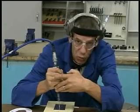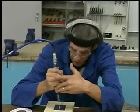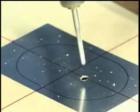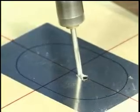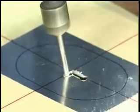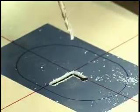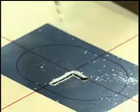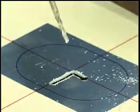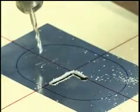The trigger is pulled wide open at all times, so it makes a lot of noise and a lot of swarf is going to be flying — just stay in control. So there, I've done a little initial cut, feeling the force of the tool and how it wants to drag in one direction. I was able to keep it nice and straight along the line, so I have confidence now that I can approach the blue line and cut out my shape.